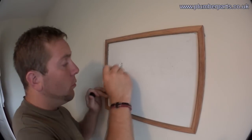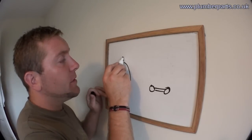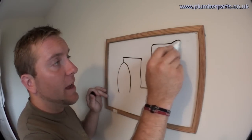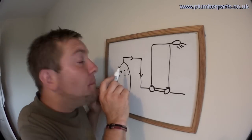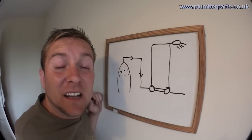Normally, you just have your hot water tank and your shower pump, and usually out the top of the tank you'll just have your hot water going into the shower pump and then pumped off to your shower head. On this side you have cold coming in. The problem we often have is you have air bubbles in here, and they can percolate up into this pipe, down into the shower pump impeller, and basically make it go wrong.